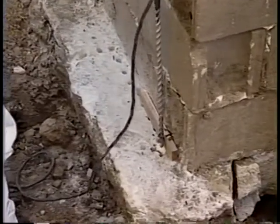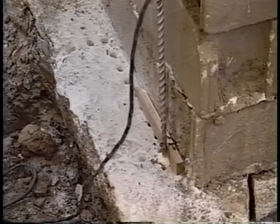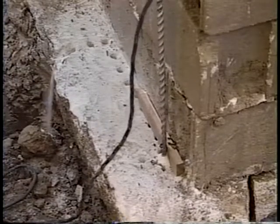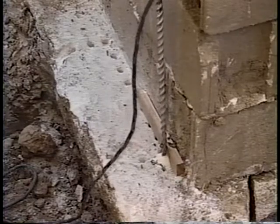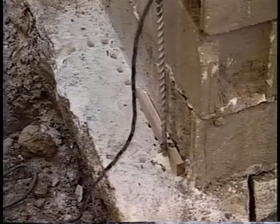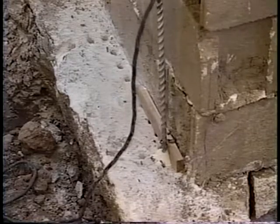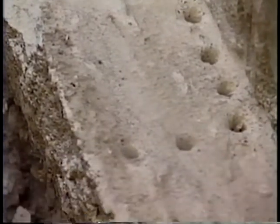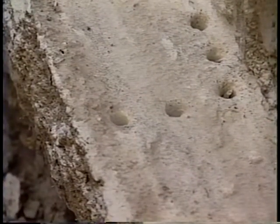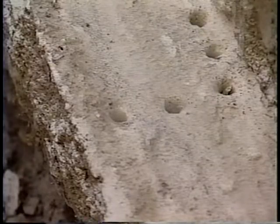Using a rotary hammer drill, such as a DeWalt model 25650, drill five-eighths inch holes through the footing approximately three-quarters of an inch away from the wall. Placing a one-by-two board standing on edge along the wall is a great way to keep the holes straight in line and save you time later during footing preparation. Drill the holes every two inches for a total length of 18 inches along the foundation.